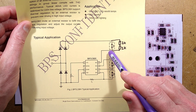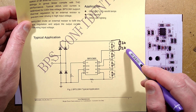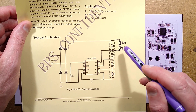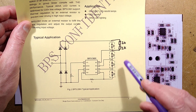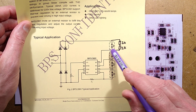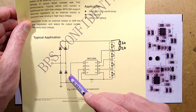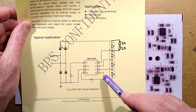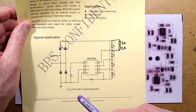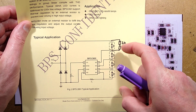Interestingly, for the final stage they've actually got two 2K resistors — 4K in total — across that, which is quite unusual. They've done that separately to each and every chip but then commoned all the parallel connections up. There's also a resistor that sets the current via the current sense: the current flows through the LEDs, goes through the current sense resistor, and it regulates the overall current in the circuit.